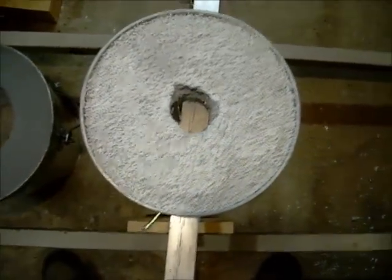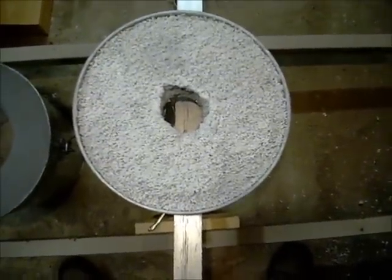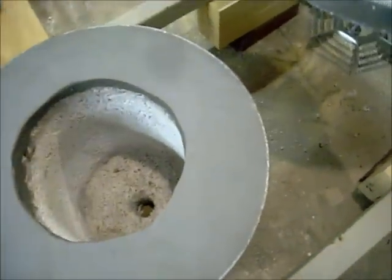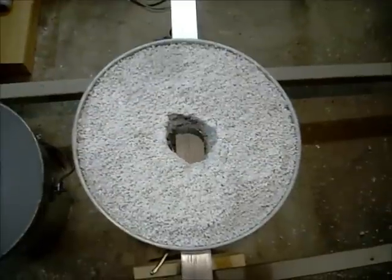That's the lid at the state I pulled the part out. I'm going to patch it and probably just use the high-temperature cement to fill it all in instead of putting more perlite in there — it doesn't serve any purpose there since I'm going to have to line it anyway. I took a torch and put it through the side hole and hit one side — that side is now pretty dry. However, the opposite side where the torch was pointing from is not so dry, so I'll hit that a little more tomorrow. It did put off a little fumes the first time I was heating it, so I think the first full burn should definitely be done outside.